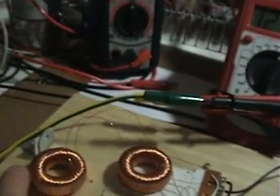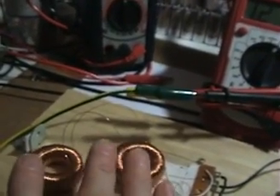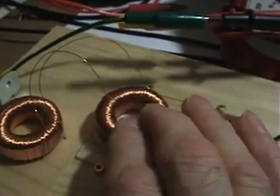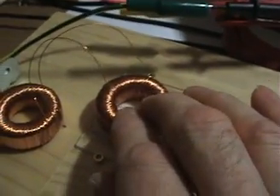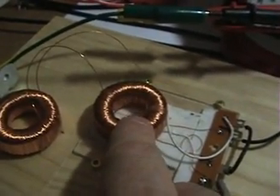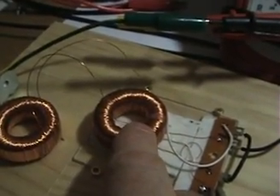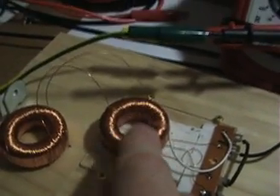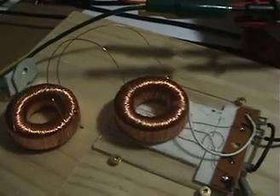There's no point in testing this coil — it's that simple. This one performs half as good as that one. I can get this one to just barely go to zero when I get the right balance of magnet and leftover inductance. The secret is: you want the highest inductance possible. If you want to replicate this effect, wind it so that you have two, three, four, five, ten Henries — go all out on inductance, that's where you're going to get your benefit.